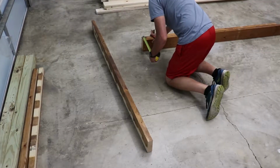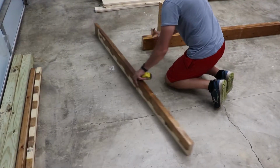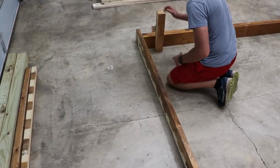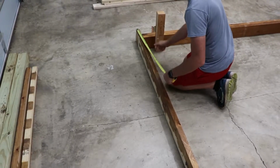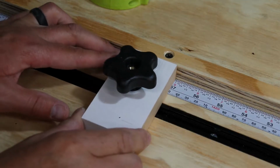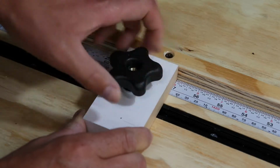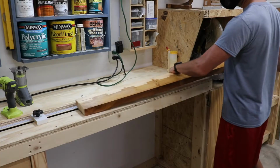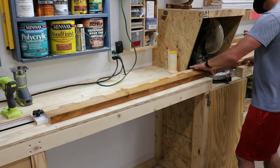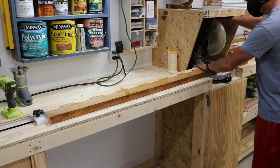But anyway, I'm building this platform bed frame using wood from a previous bed that I built for my sons. It was a double floating loft bed, and I'll leave a link in the description below if you'd like to check it out. The perimeter of the platform bed is 2x6 pine boards, and that's what I'm cutting to size here. Since the bed will be full size, I'm making the sides 75 inches long and the pieces for the end will be 57 inches long.